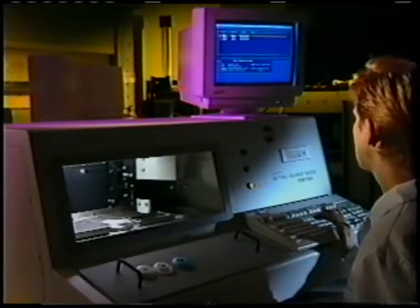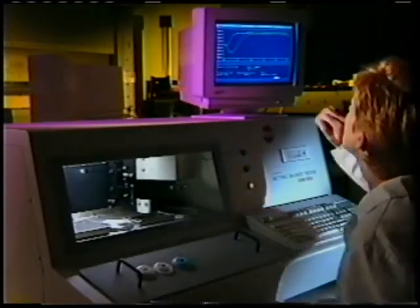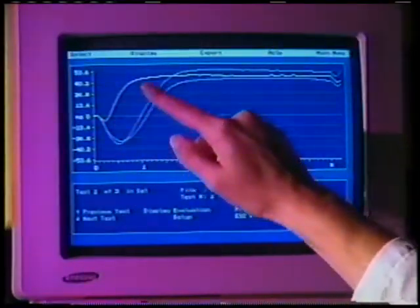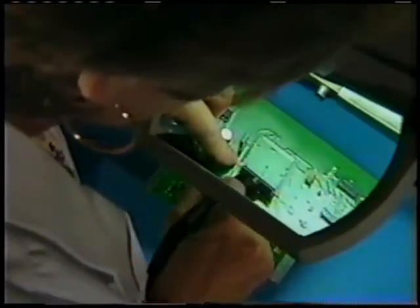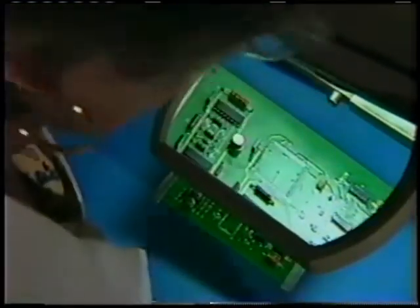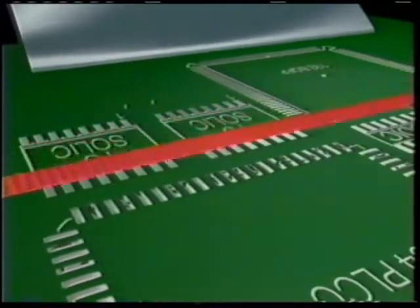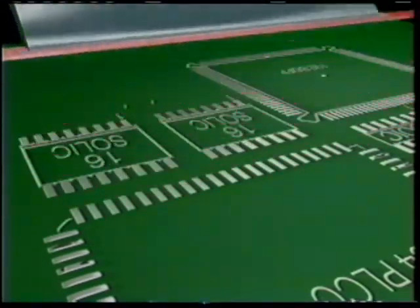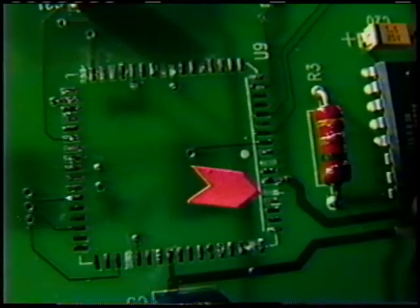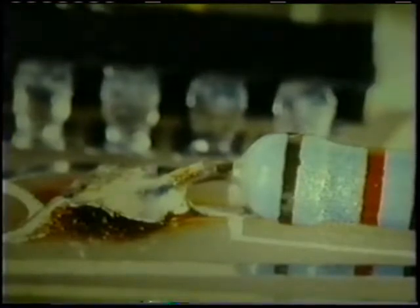Soder Wick brand desoldering braid meets the mil spec for desoldering speed unlike other brands. It is the fastest braid ever, even when compared to the competition. Soder Wick is hands down the fastest. Being fast is good because it saves you time, but it could also save your board from heat damage, that is, with less heat transfer from the solder iron tip to the board. So fast is cooler. Leaving the solder iron tip on too long can cause major problems. Lifted lands or pads, those new components won't work right for long. Too much heat for too long, you damage the surrounding components too.